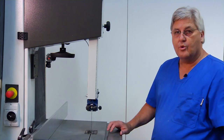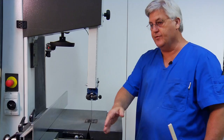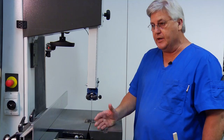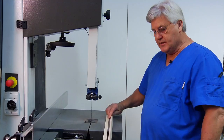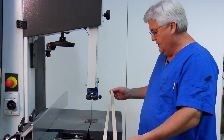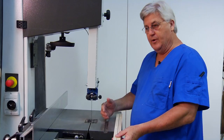You're going to want your bandsaw wizard table mounted on your existing table so it rides perfectly perpendicular and parallel to your blade. If it's off a little bit, everything else in your T-slots will not cut properly — you won't get a 90-degree or 45-degree cut. So it's important that you put your guide runner in here and find out which one you need, because there are actually two guide runners that come with your bandsaw table. There's one that's three-quarter and one that's a little under. All of these slots aren't always the same size — traditionally they're three-quarter, some are under, some exact, and the older ones are a little over.